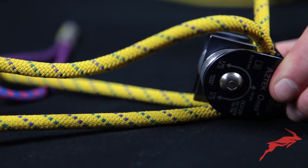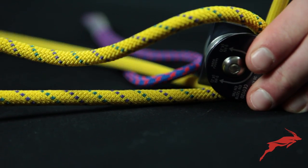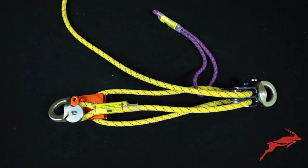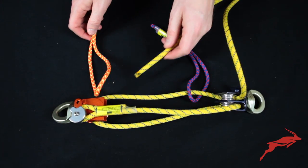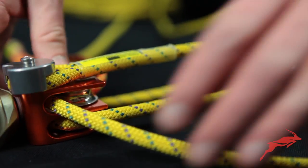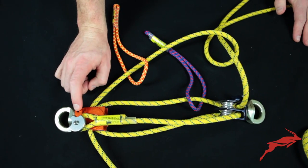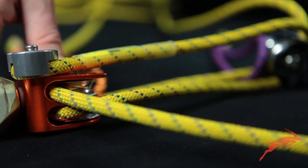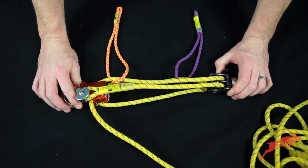Pull your slack through. At this point we're going to lay out our light ratchet, or the orange ratchet. We're going to pass through like so and feed out through the top block, coming in on the Beckett pin side, exiting on the Beckett cover side. All threaded.